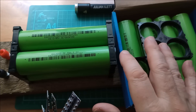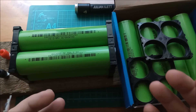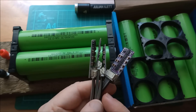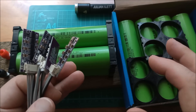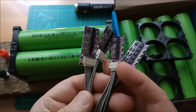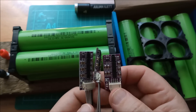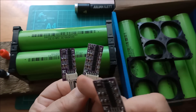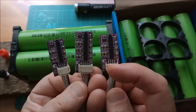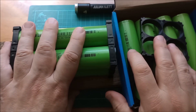So they can be middle or center balanced. I don't intend to top balance or bottom balance these because I don't intend them to reach a full top charge or drain to a full bottom charge — they'll always be balancing around the middle. I'm going with a 3-4-3 arrangement: a 3s balancer, a 4s balancer, and a 3s balancer, with overlaps between the 3 and the 4, and the 4 and the 3, and that will work as an 8-cell balancer.